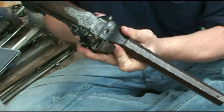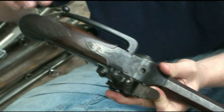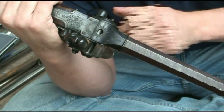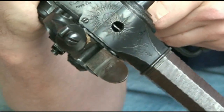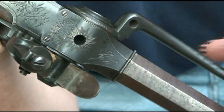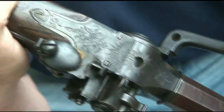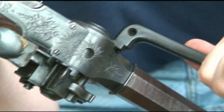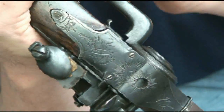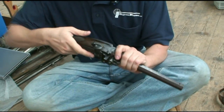Close this. So the way this works, you tip the pistol down so the powder and ball are facing down towards the barrel, and run this lever around. It first loads a charge of powder, and then as you go farther, it loads a ball into this central cylinder. And then it closes the frizzen and re-cocks the hammer. When you roll it back, it drops the ball into the barrel, then it drops the powder into the barrel, and it's ready to fire. And you fire it.